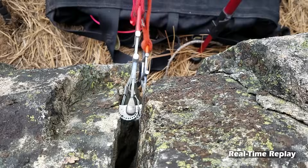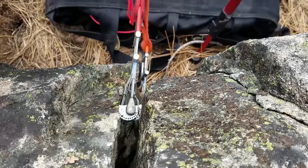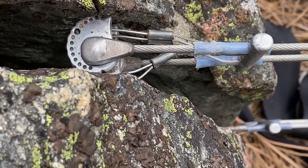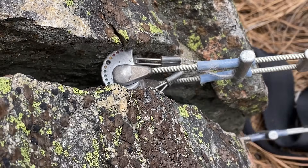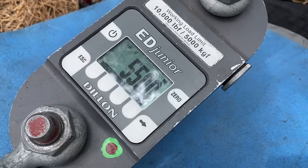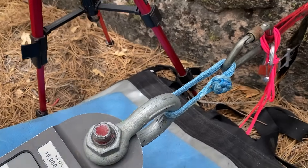Whoa! So those lobes are almost fully open and the rock cracked. It's just grabbing that now. We're going to keep pulling this — if it slips out, we can always put it back in. It slipped. We didn't get any slippage when we were pulling it not in line. At 5.5 kilonewtons, it slipped. Well, let's just keep pulling — that's what we're testing.